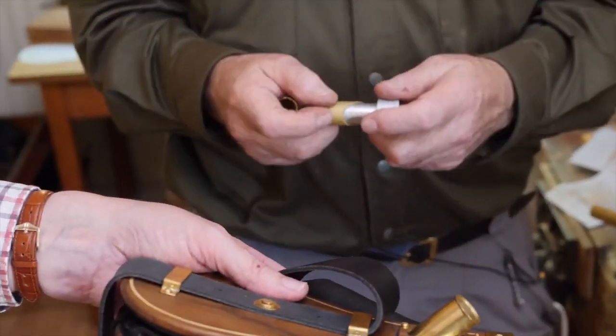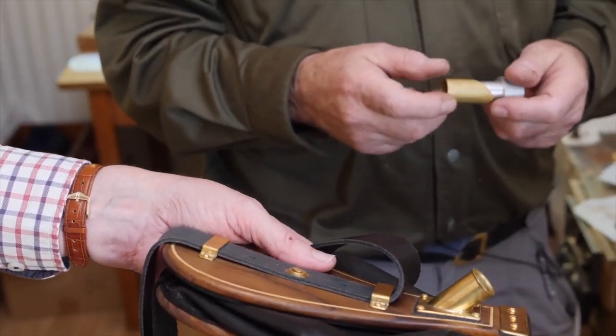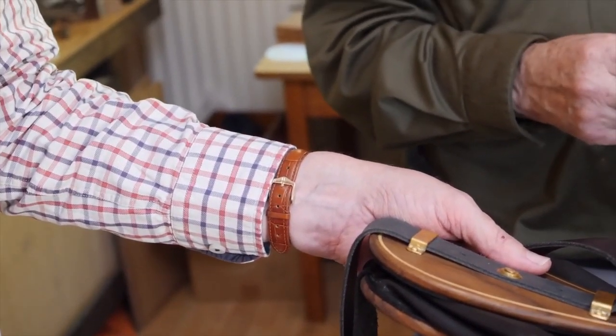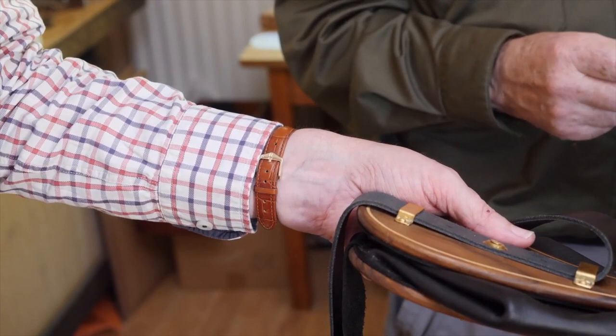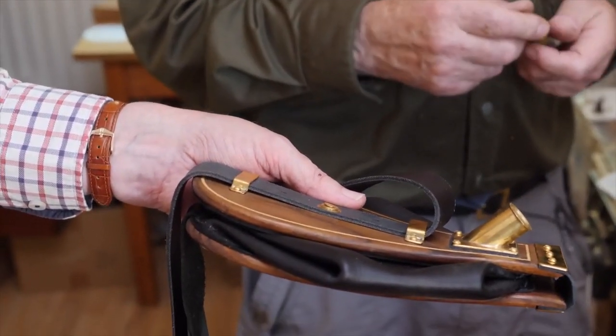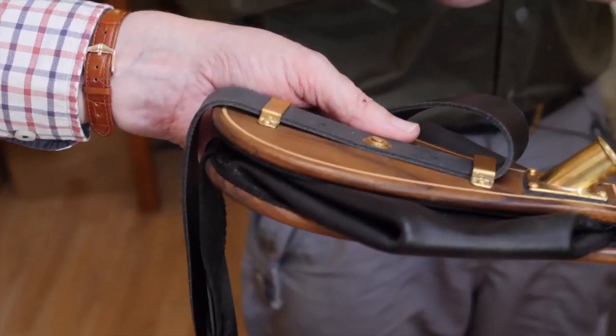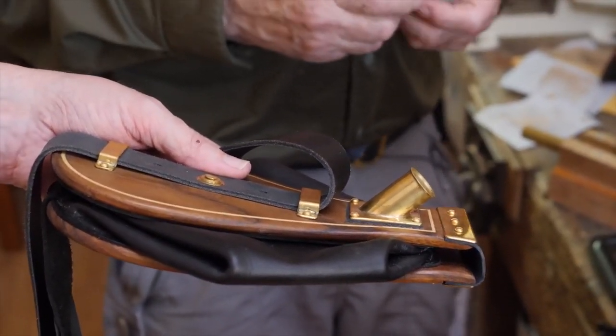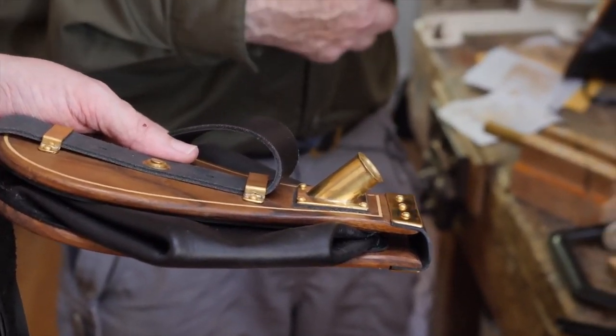And if you finish it off with a little bit of abrasive sandpaper or steel wool or something, it looks even nicer. And it ends up like the one in front of us here on the set of bellows with just that flare. Okay, so the next bit would be silver soldering the tube onto the base plate.